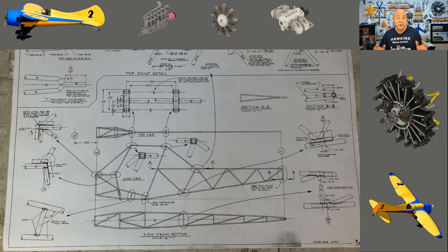When you get your plans and start looking at everything — to me they're pretty good drawings — but there are some things that, if you're not ready for them, will make you scratch your head. Keep in mind this was originally offered as a kit, so you'd buy the kit and get a pile of wood, the fuselage already welded, and some parts already prefabricated. When you're building completely from plans, all those prefab parts you're going to have to build yourself.